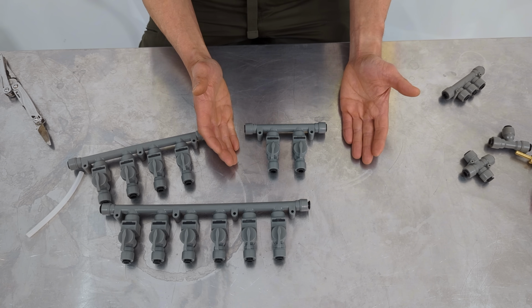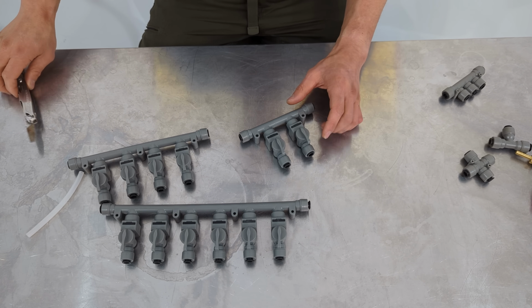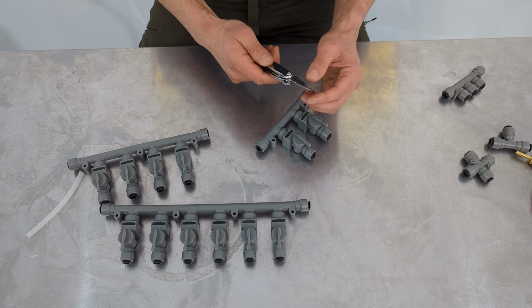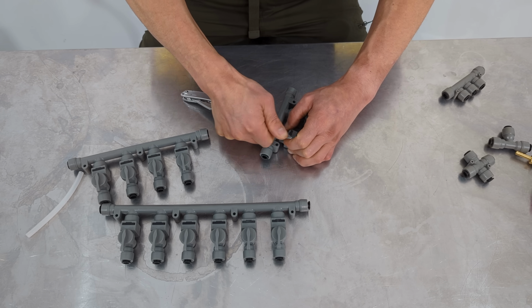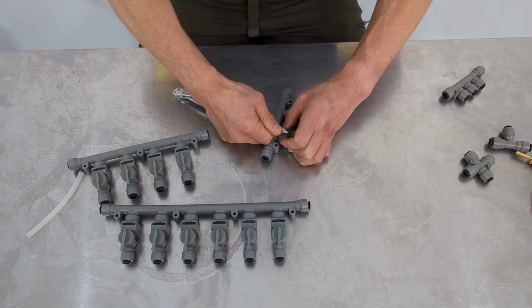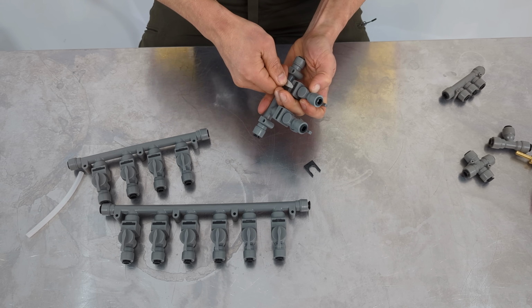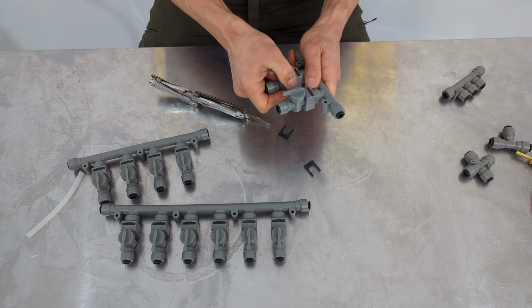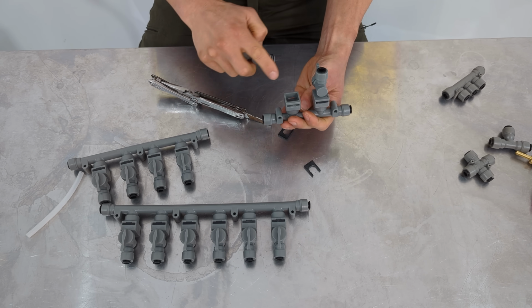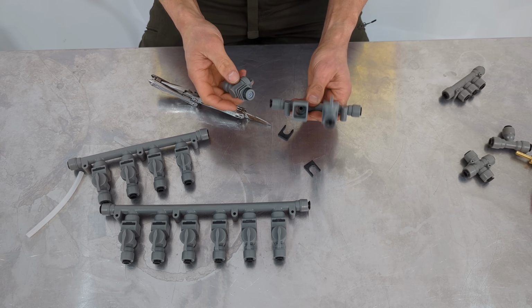However, if you need to take apart this device to clean it or get to the check valve, for instance, what you can do is basically use just a flathead screwdriver, something like that, and just lever out these clips in here, like so. And there's one clip on the front and there's another clip on the back. And you'll see the entire ball valve is fairly easy to remove. So there's two good things about this. Firstly, cleaning is really easy. So you can basically wash this whole thing out, fairly easily.